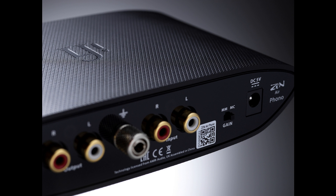In this circuit, a filtering capacitor with a 10 µF rating is equivalent to 200,000 µF at lower, audible frequencies, delivering superb filtering power. The power supply circuitry is located on its own island on the circuit board to ensure there is no contamination of the audio signal — just super clean ±15 VDC.